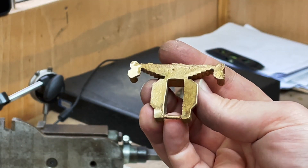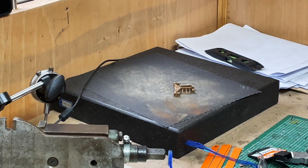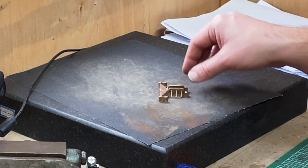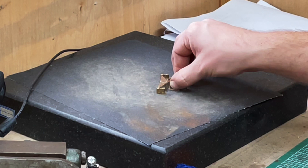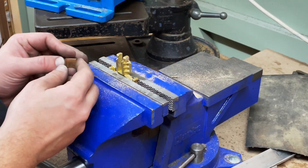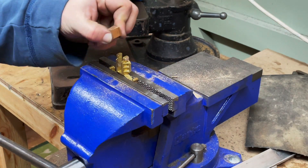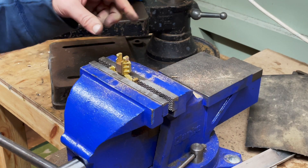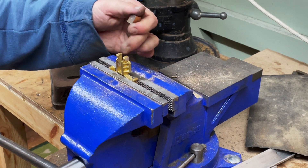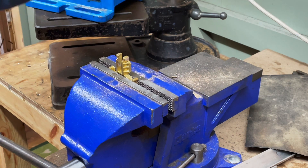As you can see, because it's a brass casting, it's a bit dished on the back, so I'll need to flatten that out on the surface plate. I am aware it's fully illegal to use the surface plate to put wet and dry on and then get things flat with. Here's an axle box — this is the casting and it actually fits in from the back. It's not the world's worst fit, but it definitely needs some work. I think we can just tidy this up with some hand files and we should be in a fairly good position.